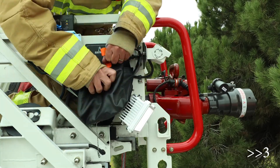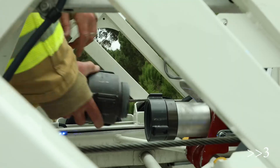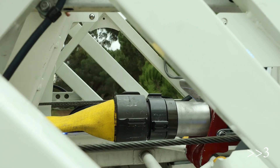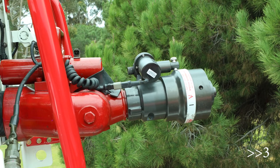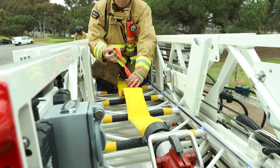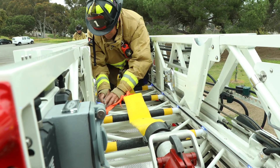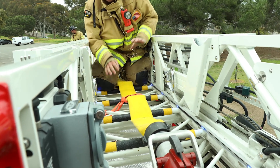Connect the electrical connections from the aerial ladder to the ladder pipe. Attach the three-inch hose to the ladder pipe. Spanner tight all nozzle and hose coupling connections. Secure the hose to the ladder utilizing a hose strap with a cow hitch two to three feet from the coupling and around a fly section rung with the carabiner resting on top. Personnel will now exit the ladder.